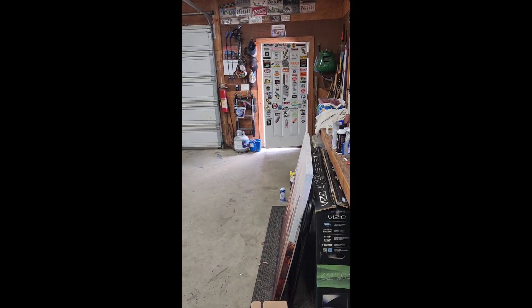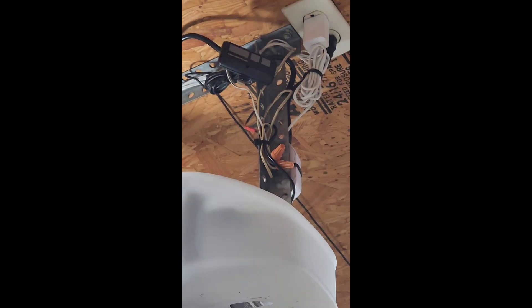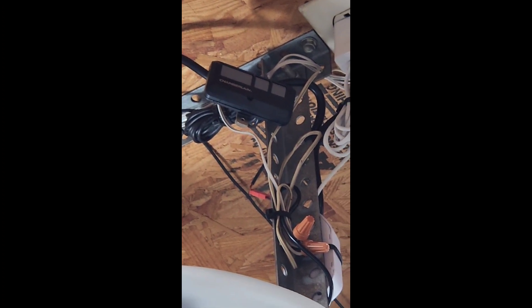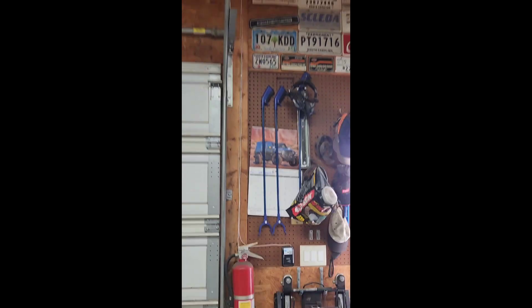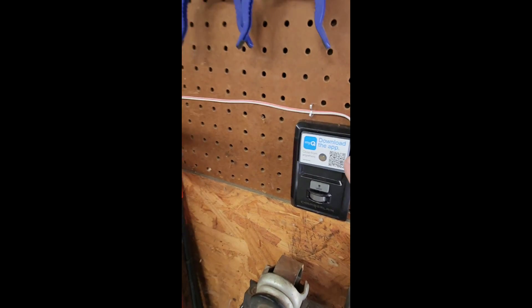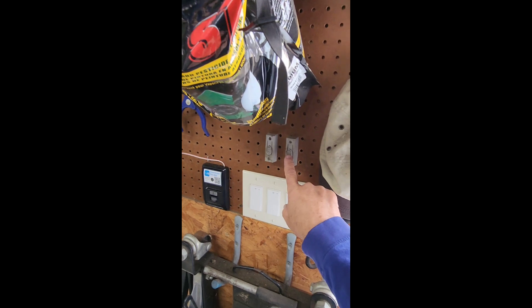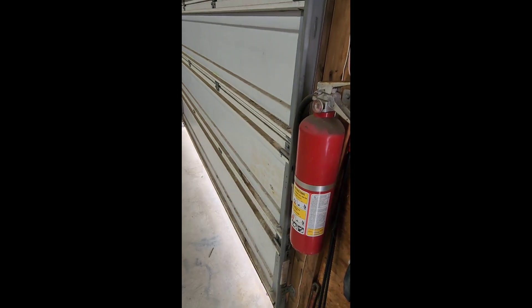I will have my old button working along with my MEROS. I actually have another garage door button hardwired from an old telephone line running all the way into the house, so that'll get all my old buttons still working again along with my home automation. I got it wired in — I just hung the remote up there on the power cable and wire nutted in the MEROS. You'll notice that's the new smart control pad that operates the door, but the old momentary contact also works.